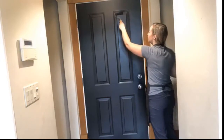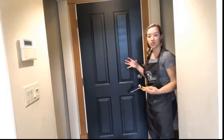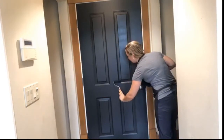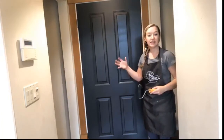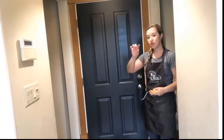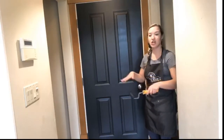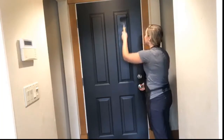If you ever get too much texture on something, allow it to dry — it'll take about two hours at normal room temperature. After that you can take a really light sanding sponge and sand off any texture you don't like. One of my customers was painting in her garage, left a window open overnight, and some debris and bugs landed on her finish. If that happens, don't try to pick anything off while it's wet. Let it dry completely, then sand that off. It sounds gross to let bugs in your finish, but they will sand off — sand it off completely and then do a final layer of paint and you'll never see it.